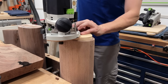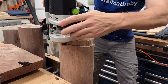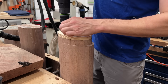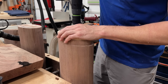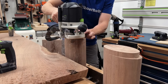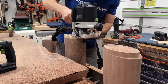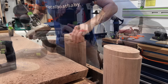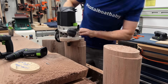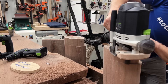While that was drying — and I didn't film this — I put the two small legs up on the slab just to check proportions and dimensions. And I did not like it. They were way too big and chunky. So I resized my template and then I had to resize my legs. I resized the template so I could put it flush on one end and then just clean up the other end. So it was a little less work, but still a lot of work. My buddy Brian Prusa said, 'If you take the template off and use what you've already routed as your secondary template, you can take even more material off — that's exactly to where your template is — which will eliminate a lot of the hand tool work.' And I said, 'Hey, that's a great idea.' So that's what I did on these ones.